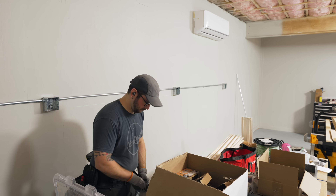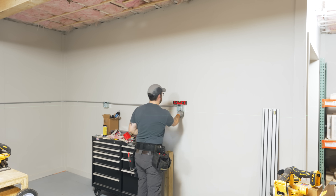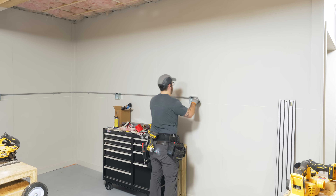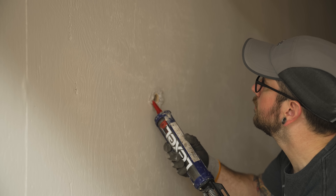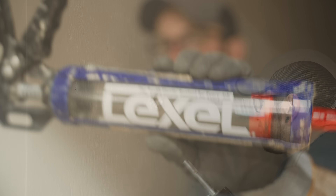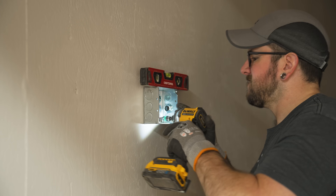From there I just repeated the process along the rest of this back wall and the right side wall. There were a whole bunch of outlet boxes — I spaced them about every five feet — and it seems like overkill right now, but honestly I don't think anybody's ever said they wish they had fewer outlets. Once I got to the end of this run I wanted to continue it on into the CNC room, so I drilled a hole through the wall, added a junction box on the other side with a piece of EMT conduit to connect the two boxes, and sealed that box to the wall with some Lexel to hopefully soundproof the CNC room as much as possible.